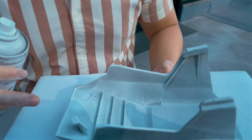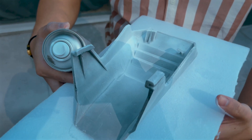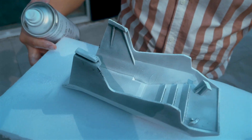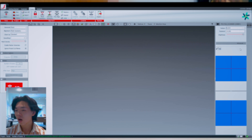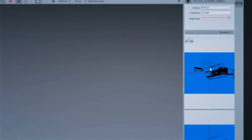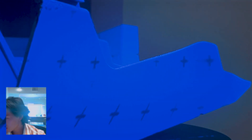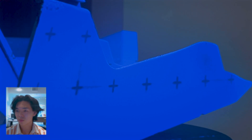The object is turning a lighter shade, which allows the 3D scanner to capture data much more clearly. It'll take approximately five minutes to dry — be patient with this process. Now that the scanner is connected, we're going to configure it to scan the object properly. On the right side you can see the viewfinder showing what the scanner cameras see. Switch to Focus mode to check alignment — if you move the camera too close or too far, the markers become blurry.